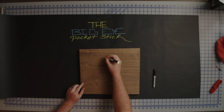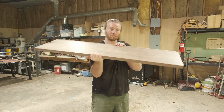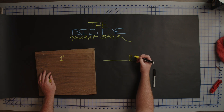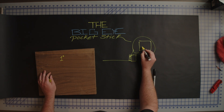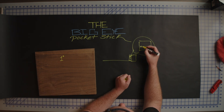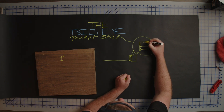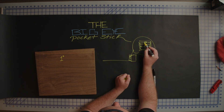I'm starting this off with one inch thick walnut. The thickness of this project is really important because the actual fence for the table saw is right here, and the way Harvey has set things up is they have a movable portion with a void in it. We want to make sure we're not putting in material that's going to rattle around too much — we want the material to be nice and snug. One inch thick material is going to give us a little bit of wiggle room, whereas three quarter inch might give a little bit too much.